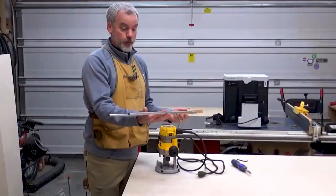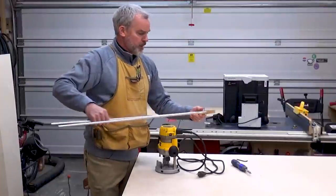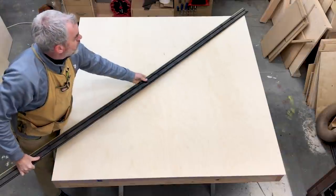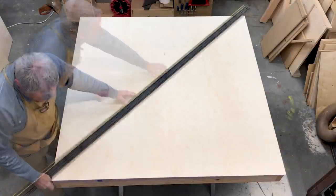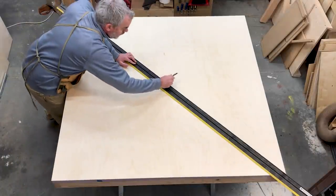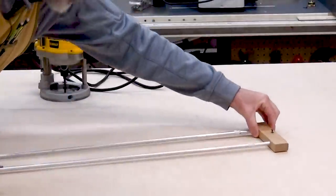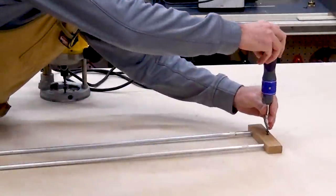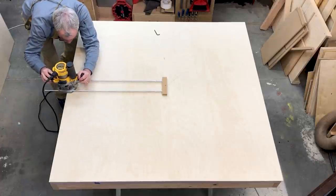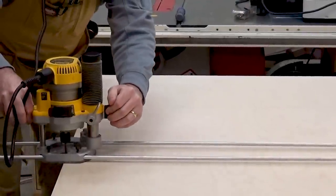This was just a temporary jig I slapped together and now I've used it for over a decade. If you want something prettier, they make a lot of them you can go buy. I connected the corners of the sheet with a straight edge to find the center, where I drilled a pilot hole and screwed the trammel into place. Then I just slide the router onto the trammel until the bit touches the edge of the plywood, plunge, and route around the circle.